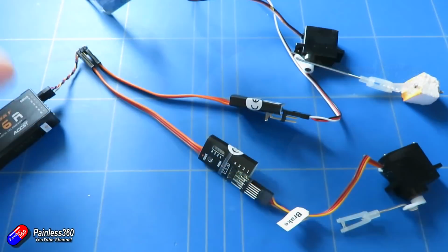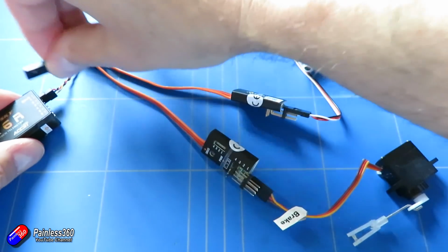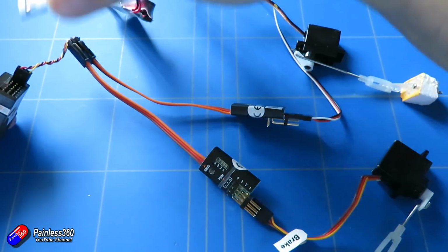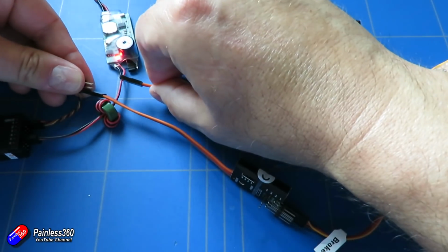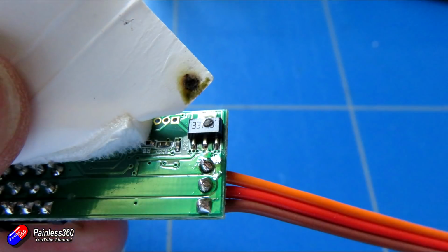Interestingly, they don't power up, so there's obviously some conflict, maybe it's an ID or something, and when I unplug one of them, the second one that was still plugged in immediately flipped out and burnt one of what looks like one of the power controls inside. I can still access it and configure it, it just doesn't work when it's plugged in. So be very careful of that. Don't try and use more than one.